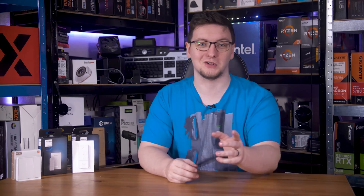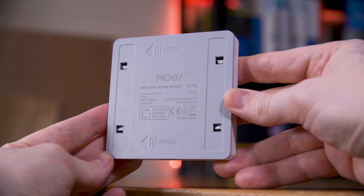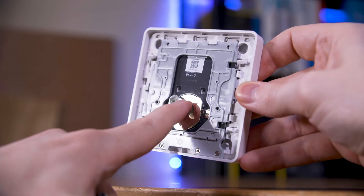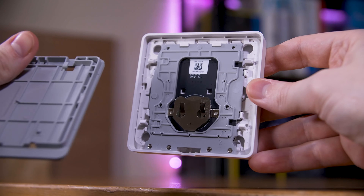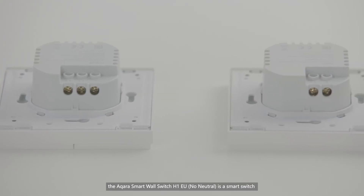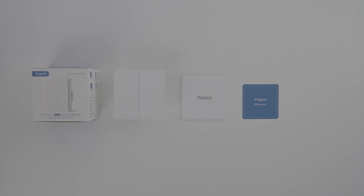You could have them close your robo blinds, lock your smart door lock — please never buy one of those — or turn up your central heating. They can do that; they're rather handy. So what do I mean by types? Well, this Hue smart dimmer is what you'd call a scene changer style switch — it's just a remote. It sends a command over Zigbee and the hub manages what to do with that command. There's no wiring here; you don't connect power and a light circuit to this. It is a battery powered remote, that's it. If you search for Zigbee switch, you're more likely to find a wall mounted light switch replacement. Those are powered and send power to something like a light bulb — they replace the switch you already have in your wall, although they're normally quite deep.